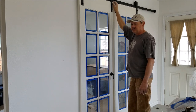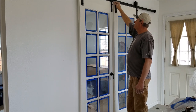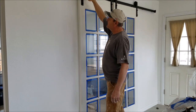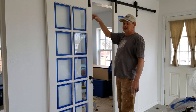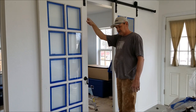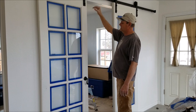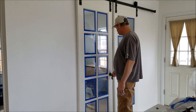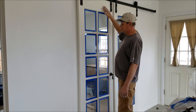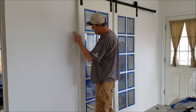The older ones were like 80 inches tall, which is about six-eight — that's normal size. Barn doors are taller because your rough opening is usually 83 inches, so about six foot eleven inches. When you sheetrock it, corner bead it and everything, the barn door has to sit higher to fill in the gaps. So we added some wood to it and filled in the old hinge holes on the side — used to have three hinges on each one.